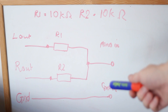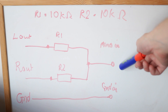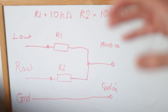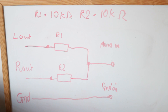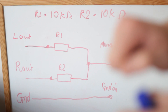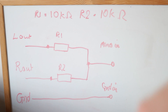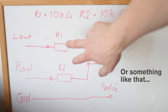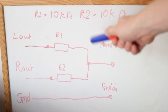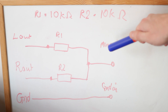This is the circuit that mixes the stereo input from the MP3 player into a mono output, so that I can put that into the speaker. Because it's only a single-speaker radio, you need to sum the inputs — that way the MP3 player doesn't think the two wires have been shorted, and the voltage spikes will be lessened. Some people use capacitors as well as resistors, but I'm just doing the simplest method. I've used 1K resistors rather than 10K — only because I don't have them lying around.